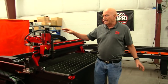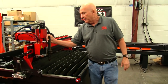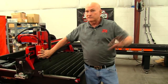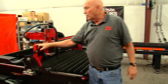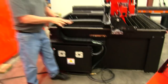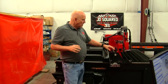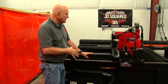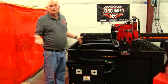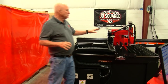I can't make a hobby machine — it has to be a light industrial machine. So this machine has all the features that the MAD has: the breakaway torch, the docking station, the optional scribe system — the exact same one that's on the MAD — the laser pointer. We're running Teknic ClearPath brushless servo motors, just like the MAD. We're running the 12 millimeter hardened rod, everything just like the MAD. We're running the same control panel, wiring, everything. You never see us having problems on the internet with our machines because we spend a lot of time engineering. We use high-frequency rejection wire made by IGUS — a very top-line company — and IGUS cable carriers. We can't cut those corners because machine life will suffer. All of our machines are designed and guaranteed that we will support them for a minimum of 30 years.